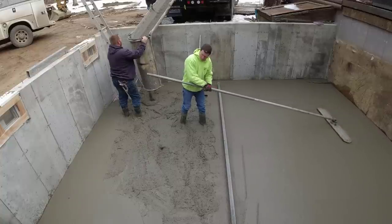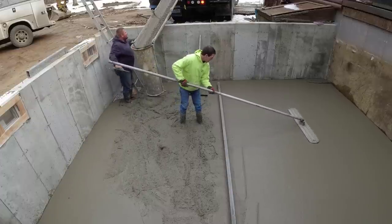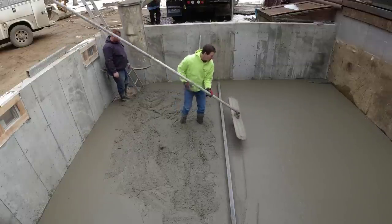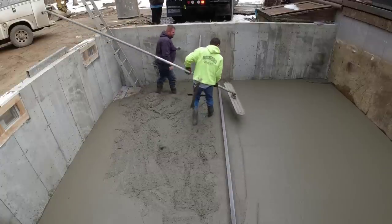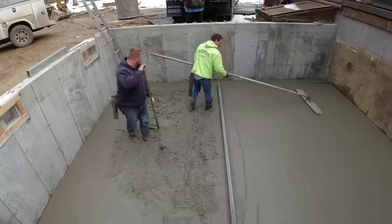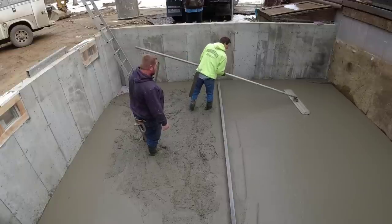With this slump — probably about a six-inch slump — I go down and back twice. Slump is how wet or dry you pour the concrete; we typically like a six, sometimes a seven when we have water reducer in it. All our loads have a mid-range water reducer in it automatically. If we want to pour looser, we ask for a high-range mix, but we didn't need that here — we could back the truck right up and dump it straight out of the chute.